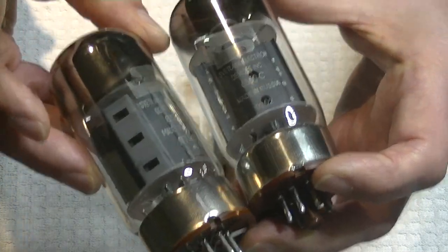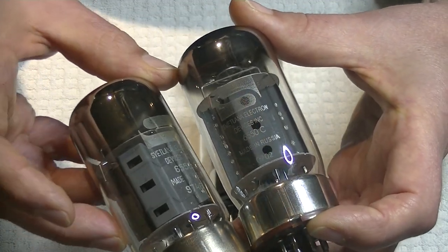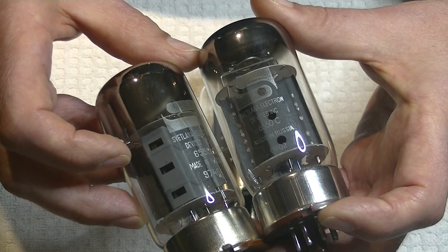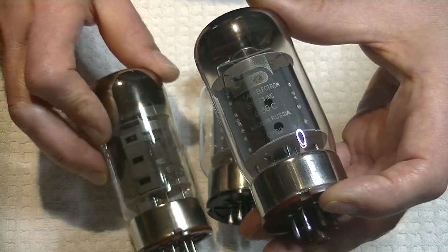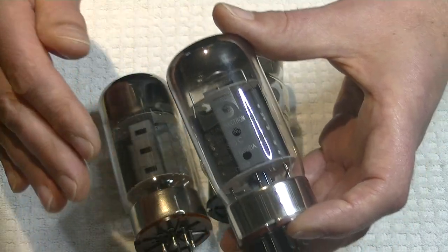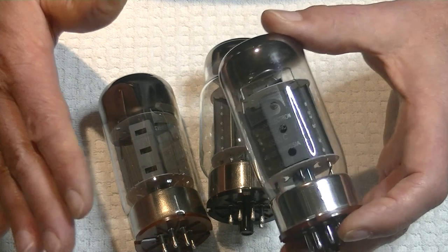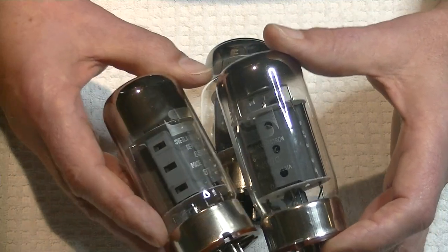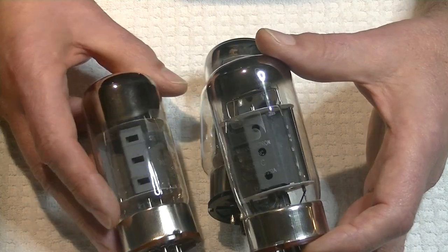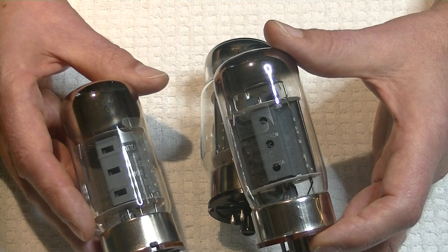So what's the big difference? The biggest difference is the holes in the plate. The real vintage Svetlana 6550 had a rectangular hole - same for the KT88. The reissues have round holes, same for the KT88. That's the biggest difference. The reissues, over time, attempted to look more and more like the tubes they were essentially copying. Are the reissues sonically anywhere near the vintage tube? No. Do they work fine? Yes. Do they have the same longevity? No - not in most cases, not in my experience.